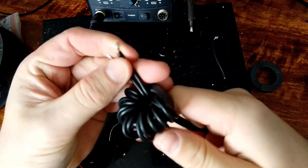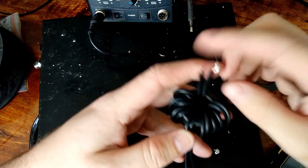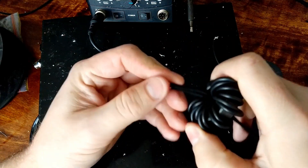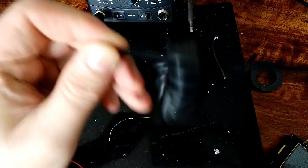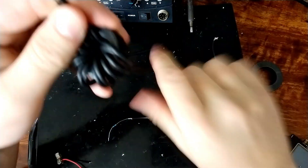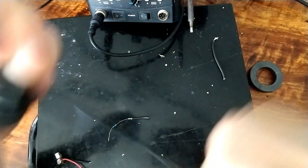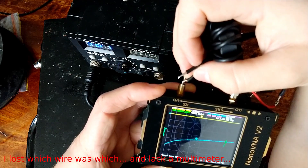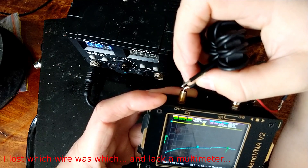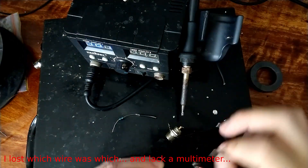While I'm at it, I may as well show you the performance of the 1 to 1 balun as well - they are testable. I kind of did it at the start of the video where I wrapped a single turn around. The way you can think of it is, if you were to short these wires together, it's just one wire around the core, and it acts exactly the same. I've got about seven turns - might be able to get one more. The more turns the better basically for a 1 to 1 choking balun. There we go - getting less suppression down at DC, which tells me it's coupling together. On this lead we get no suppression down at DC, so this here would be the center pin.